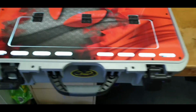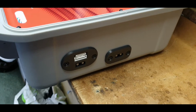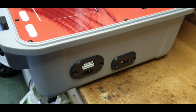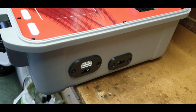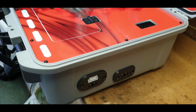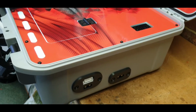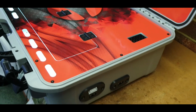And that's about it. What else? Oh yeah, we've got the connectors on the side as normal. You will perhaps see on the video at the end of this where I attach some photographs. These were another set of RGB Electrics chargers where the 4mm bullets were starting to lose their efficiency and start to get hot, so that there was actually a little bit of a solder blob on it, where obviously it had got hot in use and was starting to melt the solder.